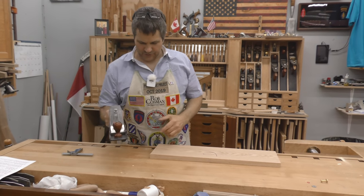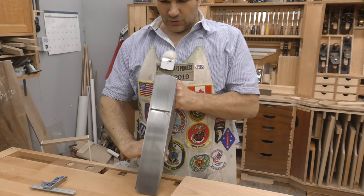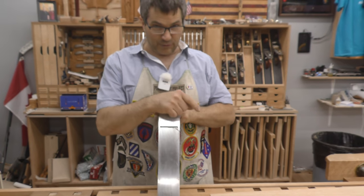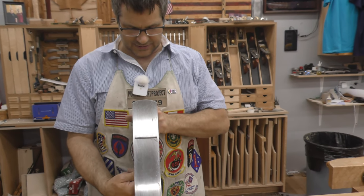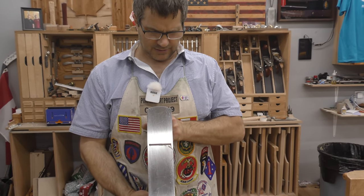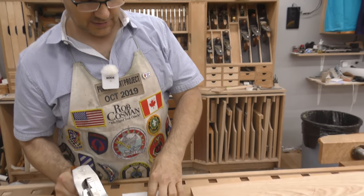I need to talk a little bit about mechanics. First of all, we want to get the plane set up. If you're not familiar with how to get it sharp and ready to go, check this video for a good refresher. What I want to make sure — and this is critical — this blade must be parallel to the sole. If it's protruding out more on one side than the other, every pass is going to throw that edge out of square. I'm going to advance the blade by spinning the adjuster knob, wipe the sole clean, and I can see I'm getting a little more blade on the far left, so I'll adjust that slightly. Then I'm going to retract it and advance it as I start to work.